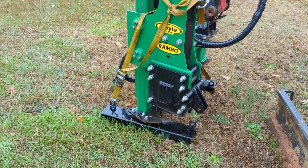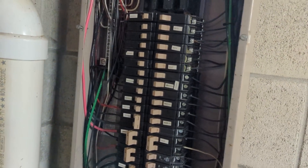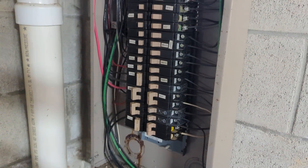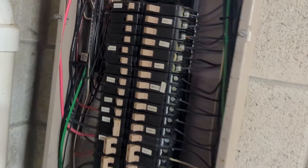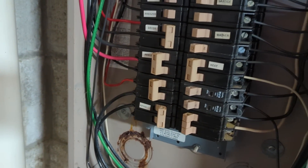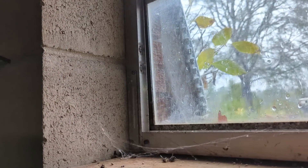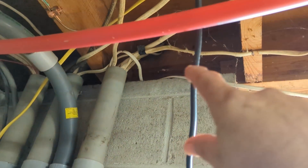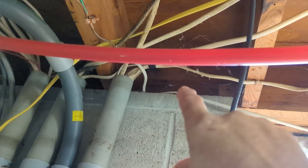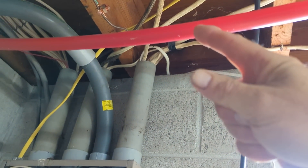Down in the basement now. This one panel does the whole house, so we're going to put our backfeed breaker in here. It's a small array so we won't have to derate the breaker. There's a dryer circuit that's not being used — we're going to pop a 40-amp breaker in there, go out to our combiner with a disconnect. Willis is drilling. We're going to head this way with our 12-4, bring it through the band into the combiner — which has the Envoy in it — and then through a disconnect and back.